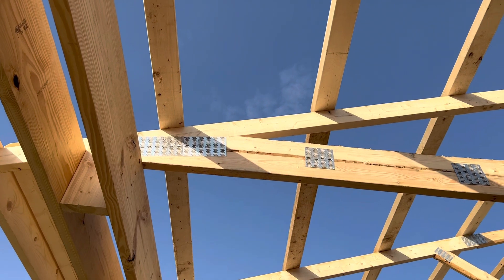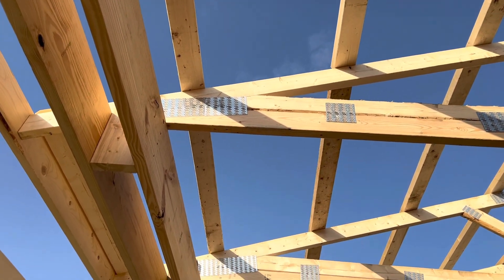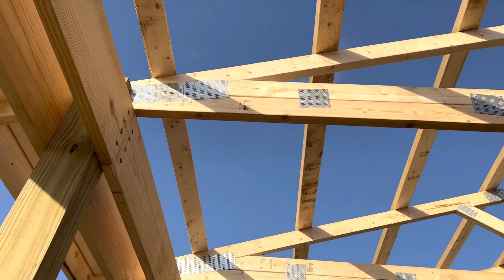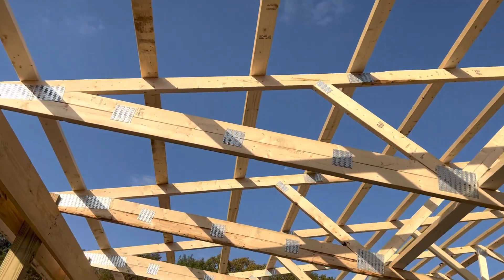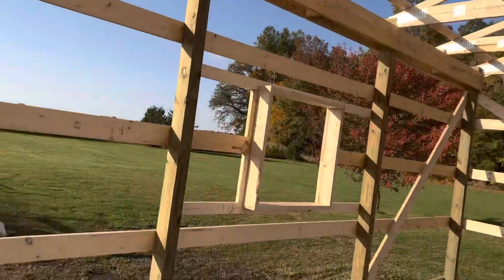Let's see how the purlins are laying flat. So we attach some metal there. A great likelihood of when the purlins are flat — a lot easier for the workers to walk on that. Again, not nailing but screwing down the metal, so you have a larger circumference to hit that when your purlins are flat and not on edge.